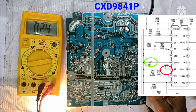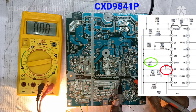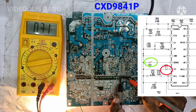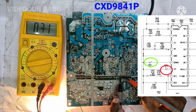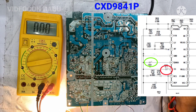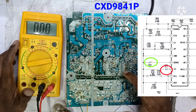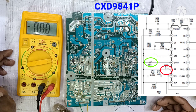The reference voltage of the programmable shunt regulator is stable at 2.4 volt. So the problem was on the primary side. The primary side optocoupler pin number three and four now reads 3.1 volt. The ampere level is perfect and only the voltage had been getting reduced — but now the power supply is working in good condition. This is the problem and the fix. Thank you.